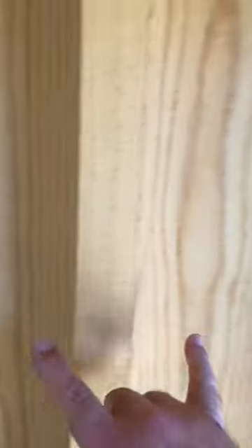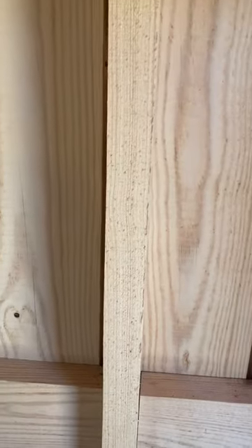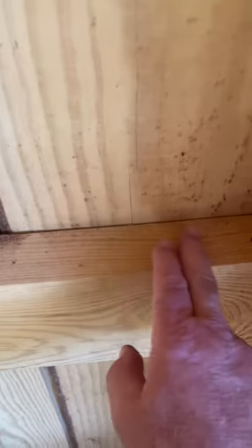The biggest thing I wanted to show you on the batten board siding: you take a 12-inch board, 14-inch board, 8-inch — no matter how wide the board, they're all cut exactly one inch thick. If they're put down and secured in the center of the board from the outside in, with your growth rings going this way, then the board will naturally want to lay down.